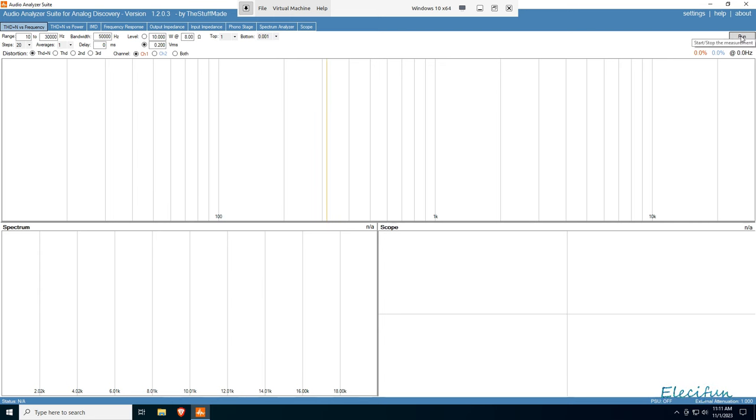So let's just check on the scope. Let's stick on the square wave. Channel 1, of course. Keep everything the same, and we're going to just go straight in for the 1 kilohertz, because that's the biggest thing. Let's do a single shot on the scope. Boom. Yeah. And someone could argue, the treble's slightly going up there, but nah, forget it. Just ignore that. That's okay.